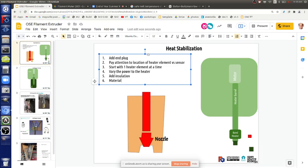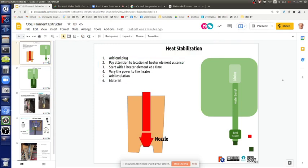That's the thing. So we definitely want to go as slow as possible on the auger once we're augering, or maybe even turn the auger on and off, pulse it, 1 second on, 1 second off. If we're pushing too hard, we have to control that we're not squeezing material out too fast and actually emptying the chamber, if not enough is melting, because now we have this one inch auger. And that motor is relatively fast. So it's just a consideration. We have to be careful that if we're augering full force, we're not emptying the chamber and creating air spots in there where you don't have enough heating.